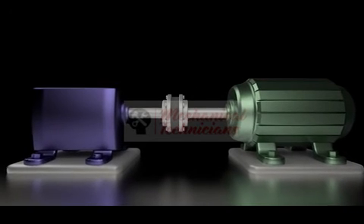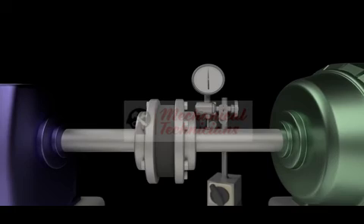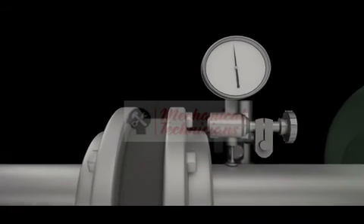We achieve this by repeating the same measurement process at the shaft. You'll want to take the measurement as close to the coupling as possible. In this case, there is 21 thou of runout at the shaft, accounting for most of the 22 thou of runout we observed at the coupling. Therefore, the bent shaft is the problem.